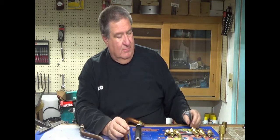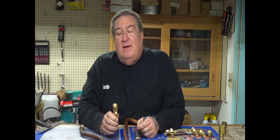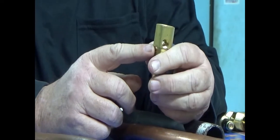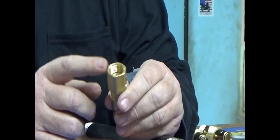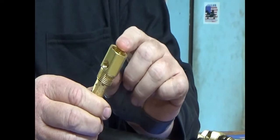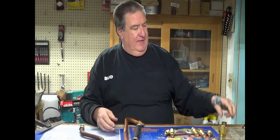This is a half-by-half pipe thread check valve — it's a female on the end. You may have a half-inch pipe going into a three-quarter-inch check valve; we have those. There are multiple different sizes available. You can have a three-quarter check valve with a half-inch pipe thread going into it. It's never a one-inch going into a three-quarter — it's always the same size or smaller going in. That's one type: your pipe-to-pipe.